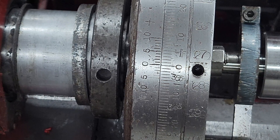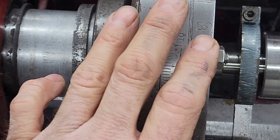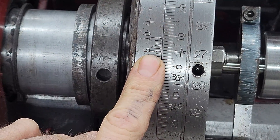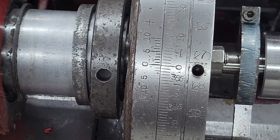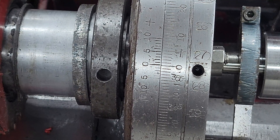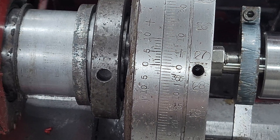All of the exhaust would be the same as all the intake because we're splitting the lobe separation here in the head. It's super accurate — normally if I put in 112, it'll be within a quarter of a degree plus or minus. I check stuff ground on CNC grinders that's not any more accurate than that. So we'll come on in and get started grinding this FE and get the first lobe roughed in.